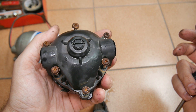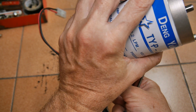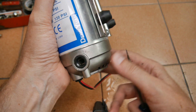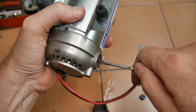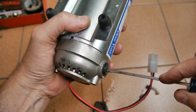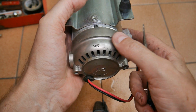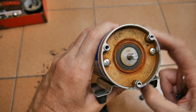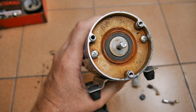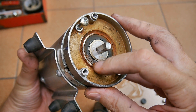Let's look at the motor. This is a brushed DC motor and I've just unscrewed the carbon brush cap. That's still in reasonably good shape. This one seems to have been cross-threaded at some point — I've never opened it so I assume it was done from the factory. And that one's okay too. The bottom is a separate piece. There are two screws — long screws that run down and fasten in there. I've got these two long screws taken out. You can see some rust around here. The pump was leaking because the rubber was decaying and allowing water into the pump.